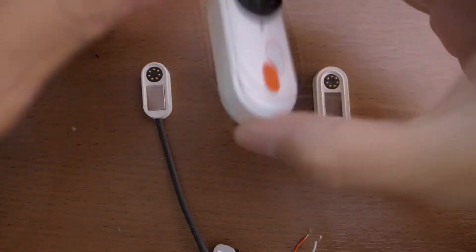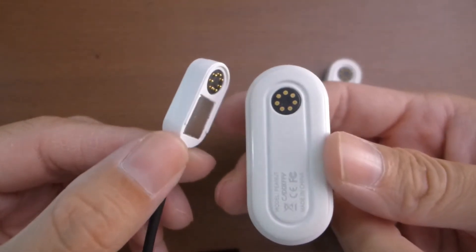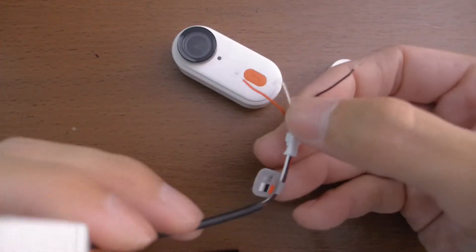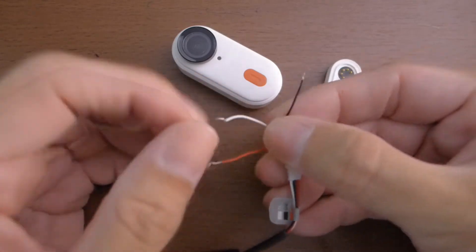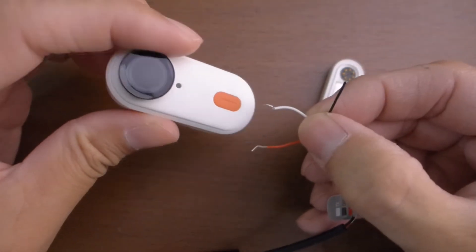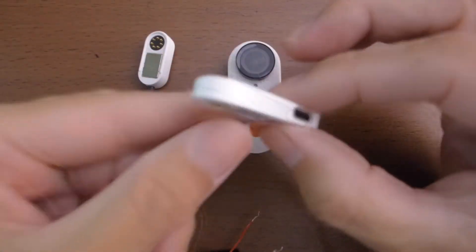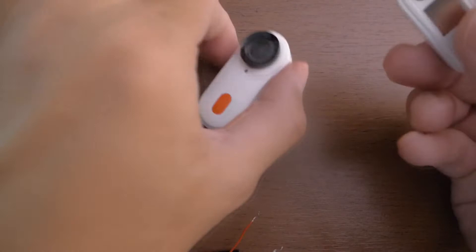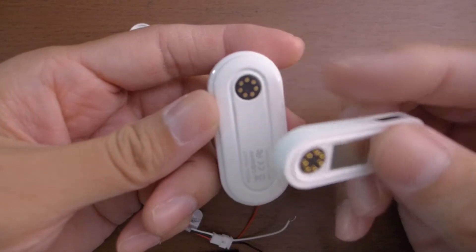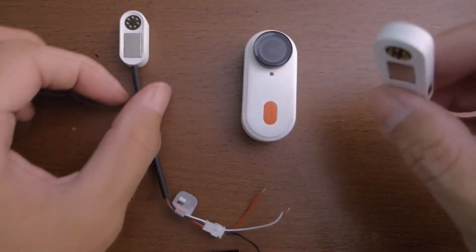What is interesting about this camera is its accessories. It has an adapter for the pin behind the camera that outputs three cables: red, black, and white. The red is for power, black is for ground, and the white one should simulate a button press to start and stop recording. The other accessory is the G3 type-C adapter, which also connects to the back of the camera.